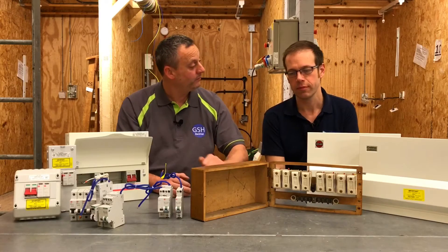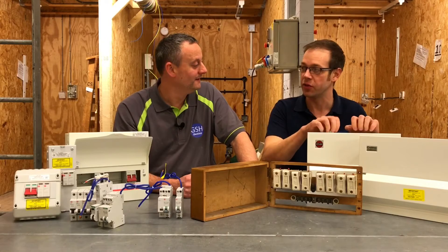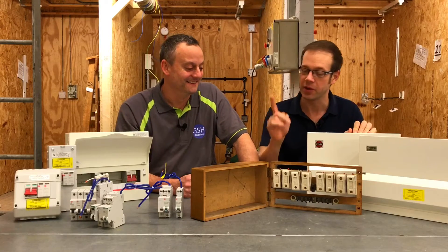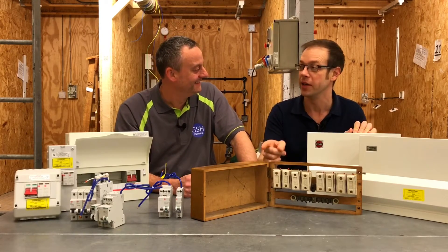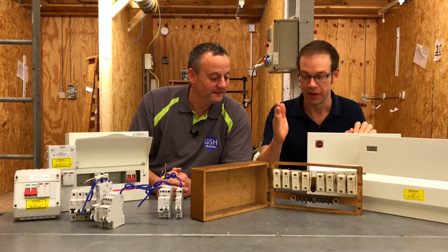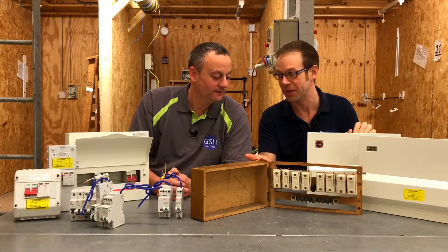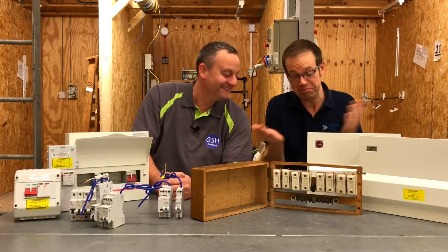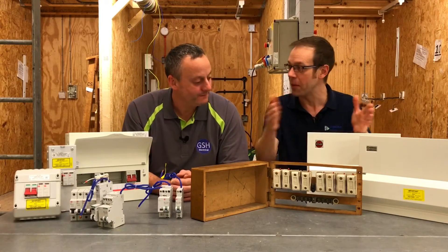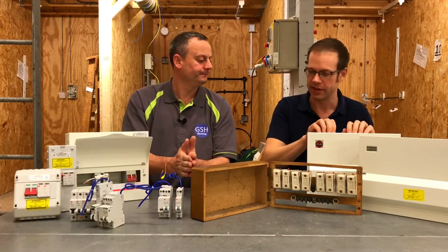Another downside — is there a downside with it being made out of such beautiful brown wood? The craftsmanship is phenomenal, however we've moved on in recent years to metal enclosures. This is made of a highly combustible material, and it's been coated in another even more highly combustible material. The leap from wooden boards to metal is significant. We've gone through the plastic years and now we're down to metal consumer units, which is really the safest it's been.